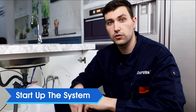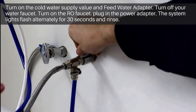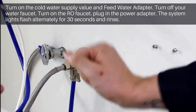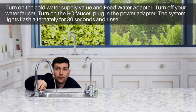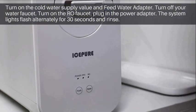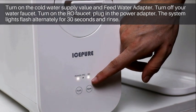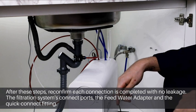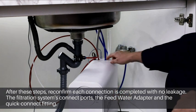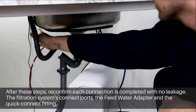Start up the system. Once you have confirmed that everything is installed correctly, you can start up the system with the following steps. Turn on the cold water supply valve and the feed adapter. Turn off your faucet and turn on your RO faucet. Plug in the power adapter — the system lights will flash alternately for 30 seconds and begin a rinse cycle. Please confirm that each connection is completed with no leakage: the filtration connection ports, the feed water adapter, and the quick connect fitting.